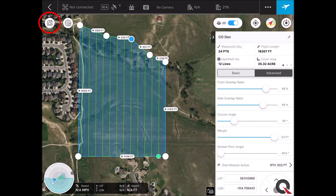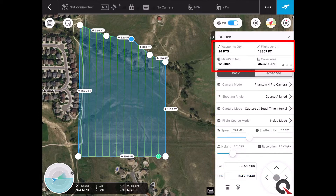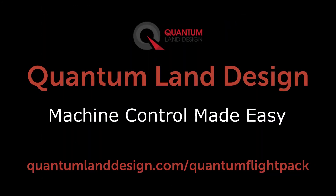Go ahead and save that — hit save over here on the upper left. Let's review the advanced tab quick: 85% front overlap, 80% side overlap — good. Everything else looks fine. Let's hit the basic tab one more time — everything looks good: 15 miles an hour, two and a half centimeters ground sample. Up at the top it says 35.32 acres for the coverage area, which is about what we expected. If we slide this over, we can see flight time too — 16 minutes and two batteries. Our experience has been you should easily cover this area in one battery in 16 minutes, but keep an eye on flight conditions in the field — the strength of the wind is the big driver for that number. Number of photos is 407, which is enough for this area. Don't hesitate to send us more photos than you think you need — we'd always rather have too many than not enough. Everything looks good. That's the basics to planning a flight plan with Quantum's Flight Pack drone system. Don't hesitate to reach out if you have any questions or are interested in the system — we'd be more than happy to help.